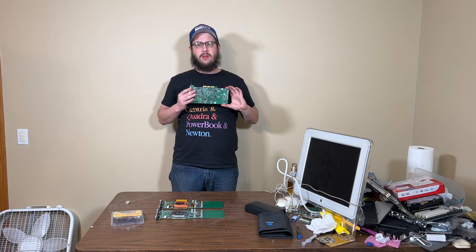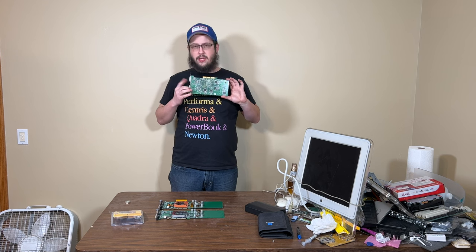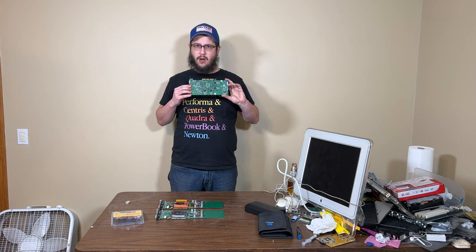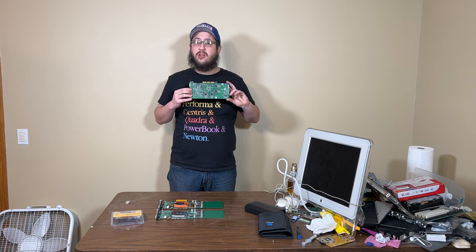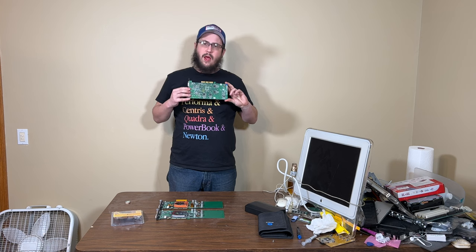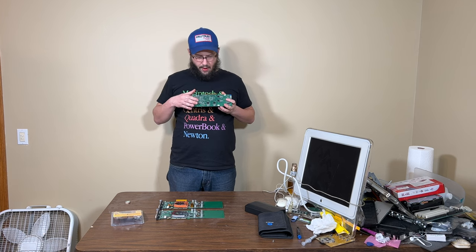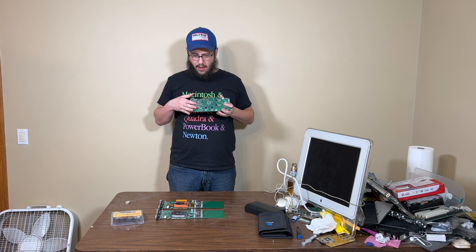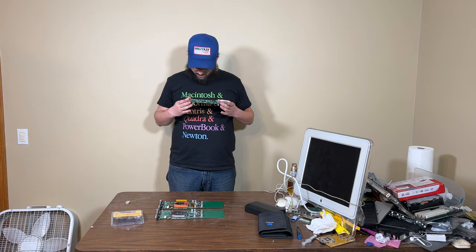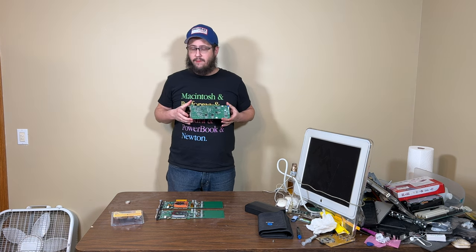Basically, there's a jumper on the back of this that changes the hardware ID on it. This jumper will tell the firmware which firmware is supposed to be on it. So when you flash it, it will allow you to flash it, okay? And there's a jumper for a Quadro card, the Ti4600, and something else somewhere on the back of this. We didn't know about that, so we went through heck trying to figure it out.